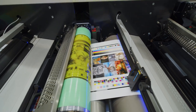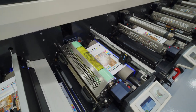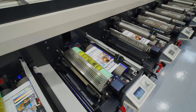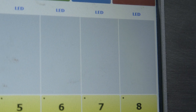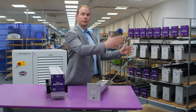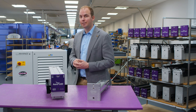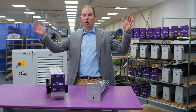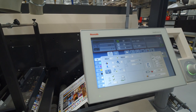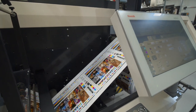A second facet is the reduction in your installed power or electrical requirement — the KVAs. Aeroled requires 60% less mains capacity than E2C, and this means that on a simple eight-colour flexo press you can retrofit two machines to Aeroled and free up enough capacity for an entirely new press fitted with Aeroled in the same total KVA. Increase your production output without having to buy expensive power upgrades from your electricity provider.